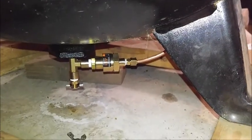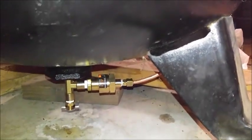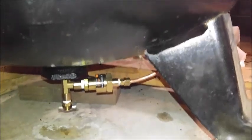Off to that is the special little device that has a hole on the bottom. It gives you just a tiny little purge - once the compressor gets to full pressure and releases the pressure from the head, it goes down here and gives a purge to open and let moisture out.